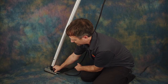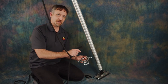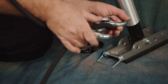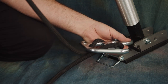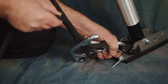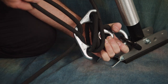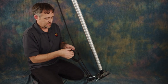On the active end of the rope, where you'll raise and lower the rig point, is where we'll use the rescue eight to tie off to the foot. When we have our rig point at the right height, make a loop in this rope and push that through the big hole in the rescue eight. Slip that loop over the small hole in the rescue eight, then take your carabiner and attach the rescue eight to the foot using any of those four rig holes. Now we can still adjust the height of our rig point. When we get it right where we want it, take the tail end of the rope, slide it down between the rope and the rescue eight, and go around at least two full times staying underneath those ears. Then push the rope through the big hole in the rescue eight and pull enough tail up to make a simple overhand knot to keep the end up and out of the way.